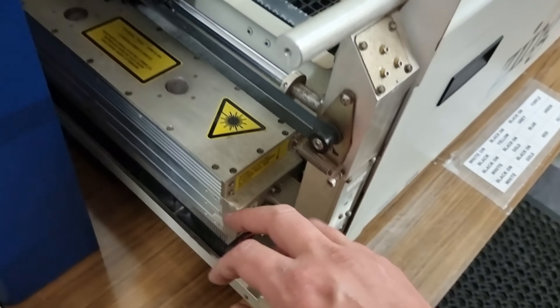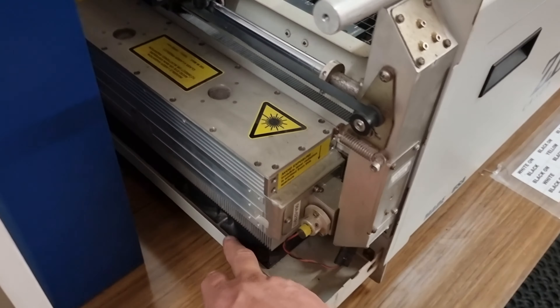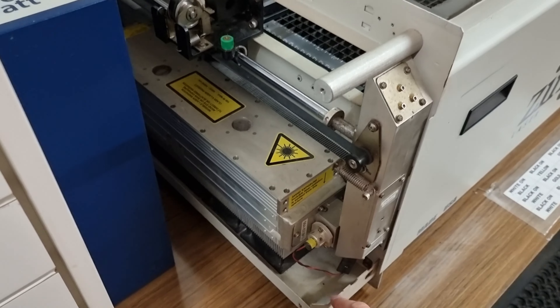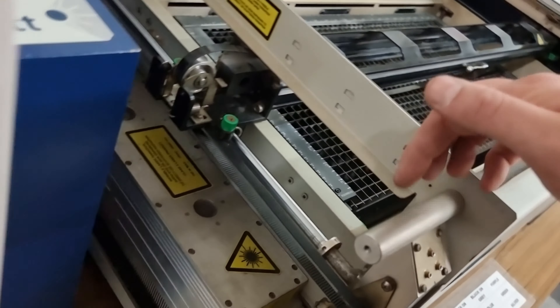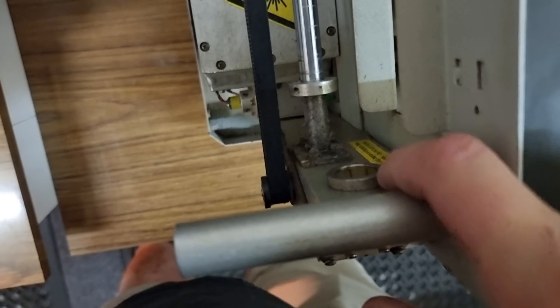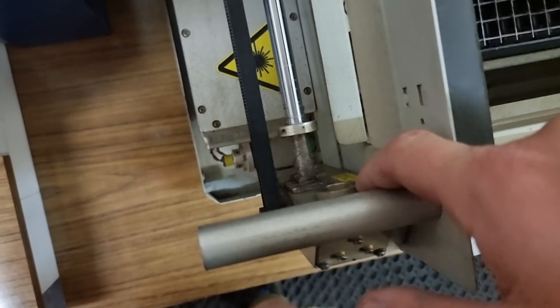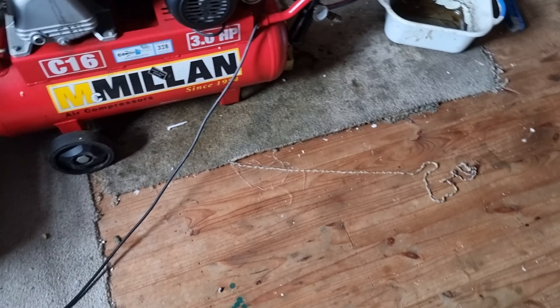This little unit is the red dot laser that tells you where things are. This is the air-cooled 40-watt laser module — you need to keep all these fins clean as well as the fans and everything in there. You do occasionally get dust in these units. This one has a covering mirror over here that keeps the dust out of that chamber, which is very good — some of them don't have that.